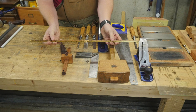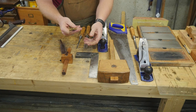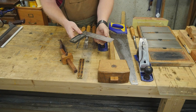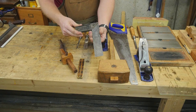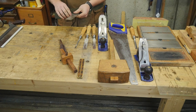For measuring, I rarely measure much over 24 inches, so I like to use this old folding rule. Any tape measure will do as well. For a square, for a long time this 6-inch tri-square was my only square, and you can do most anything with it. You do want to make sure it's perfectly square — I have a whole other video on checking your square. Once you have one you trust, this is the one I use for almost everything. If you need something longer, you can put it on the edge and use a straight edge against it to extend your square out farther.